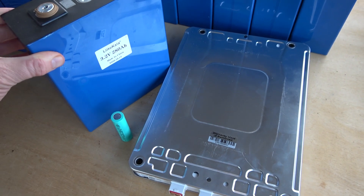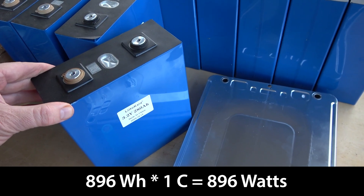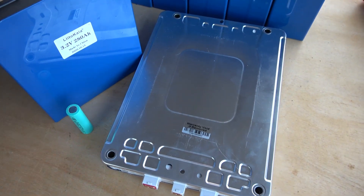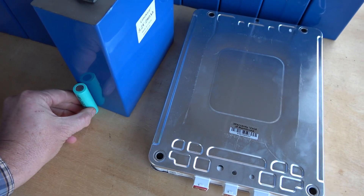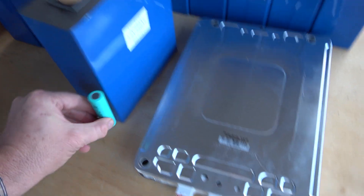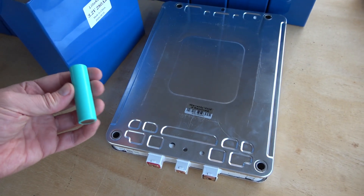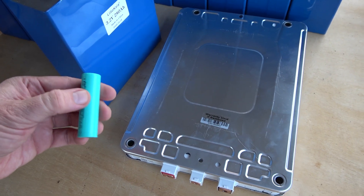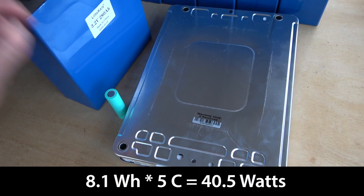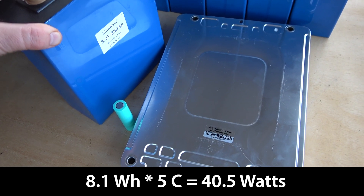In terms of power density though, this small cylindrical cell is capable on its own of outputting close to one kilowatt by itself, whereas the large prismatic cell couldn't output that much. But imagine this many small cells — probably three or four across, three or four high, however many deep you can package — to make a much higher power density pack. Given that this cell should have a discharge and charge current of somewhere between 5 and 10C, it gives you the opportunity to create a lot more power in a much smaller package.